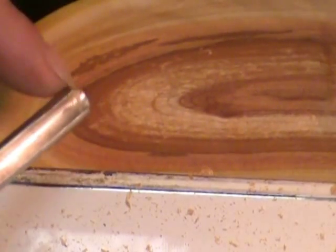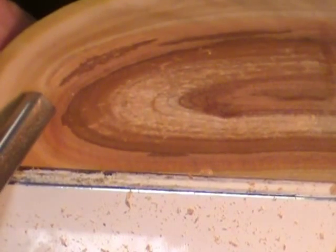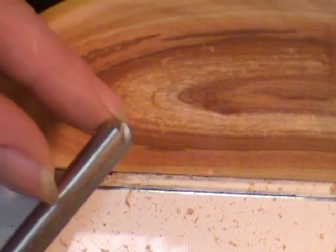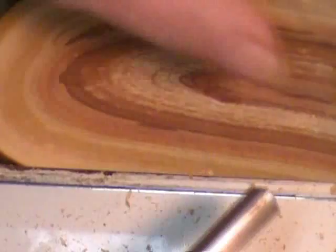I had a question as to which flute I was cutting with, or which wing I was cutting with. It depends on what I'm doing. For a shearing cut, I'll have the flute wrapped — actually rolled slightly counterclockwise — so that this wing is giving me a shearing cut. For bulk removal, I have the flute rolled clockwise, and it's actually the nose and the right-hand wing in this orientation that would be doing the cutting.